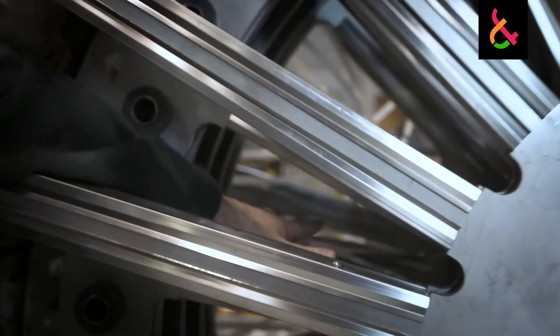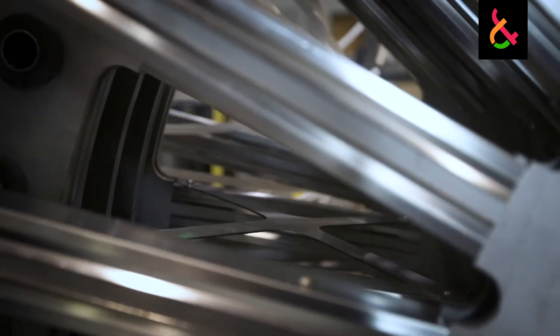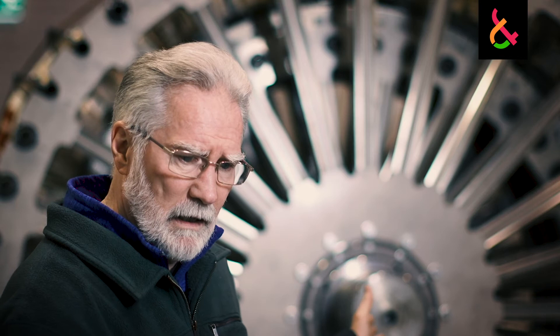It's very difficult to weld 50-millimeter thick pieces of steel together, and once you do have them welded together, over time they can crack — because of the way the heat of the weld changes the metallic structure, cracks can build up. It's expensive, it's not very reliable, and it's big and heavy. Because we've done this laminated spoke structure, we're able to make a much lighter weight machine.